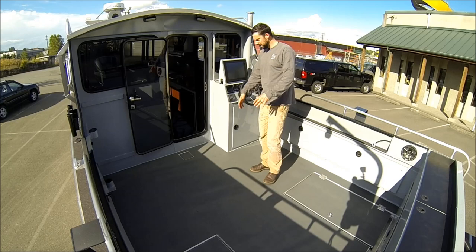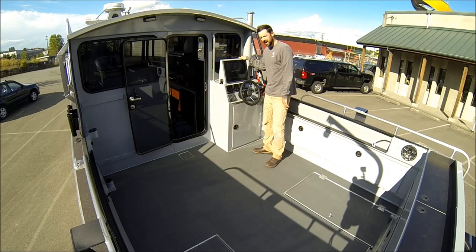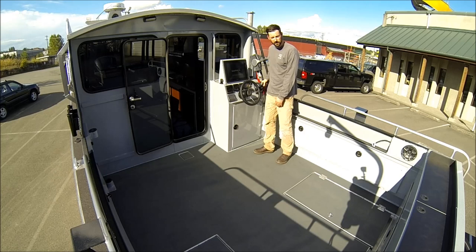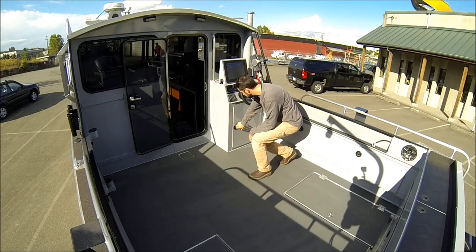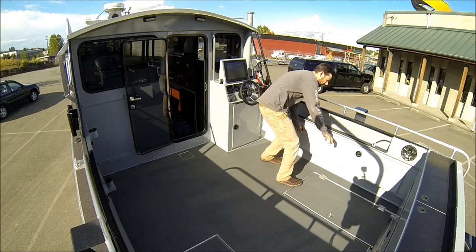Here we are at the rear helm — again a huge area with a nice Diamond Seaglaze walkthrough door. LED flood lights up above for night time. Wash-down switches, pump switches for the fish boxes. A large Garmin 8215 dual-processor touch screen at the back, GHP-20 autopilot controls, Yamaha Command Link gauges, and fly-by-wire controls for the main engines and kicker front and rear. He's got a control for a future roof crane winch for a dinghy. Inside there's storage, a Charles isolation transformer for shore power, and the pump for the Garmin autopilot. Locking rod locker doors on both sides with rods going all the way up.